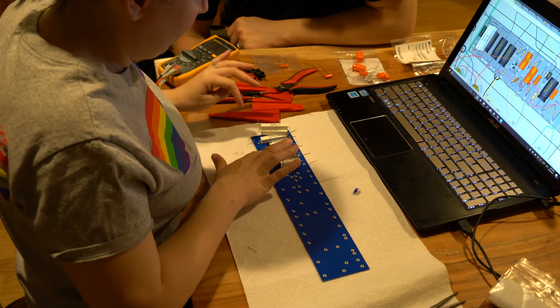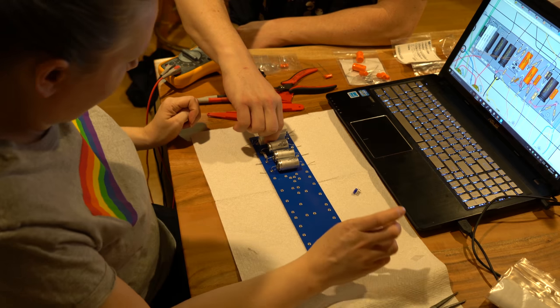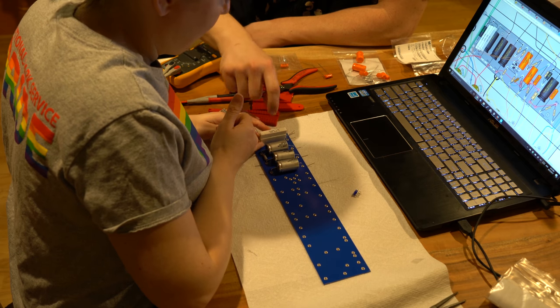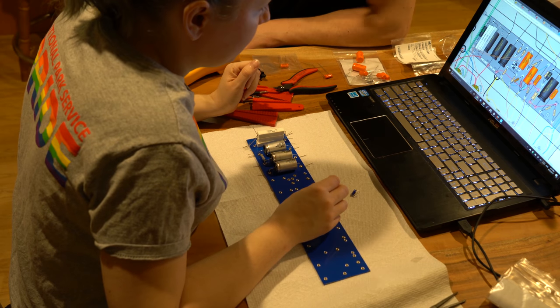Do any of these matter if they touch the board or not? Is there anything when we fill those with solder? No, the only ones that you won't want to touch are generally ones kind of like this, but again, that's part of what I was saying: this one, you would need a single 10 watt resistor for this. We've got three. So this has 30 watts of capacity, so it'll be at 1/3 its capacity. So that will be way overpowered, and that's fine.